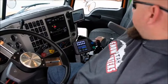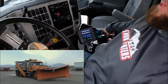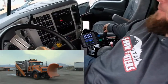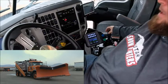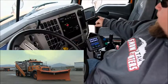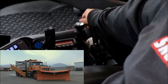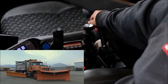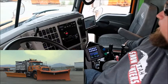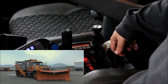On the front, here's your joystick for your front plow. Pull back — this will lift the plow up. Check it side to side to make sure you have full range of motion, going from left to right. If everything seems like it's working, go ahead and put the plow down. In your camera, watch to make sure your wing is moving up and down. Push — this will bring your wing down. On some wings there's a delay and you actually have to hold the stick a bit longer to make sure the front end of the plow gets down. It looks good and is operating correctly.